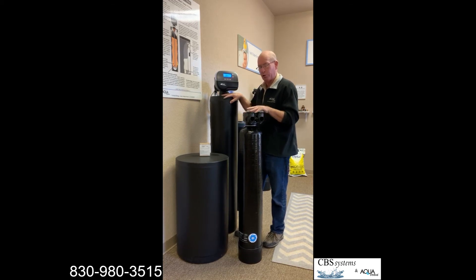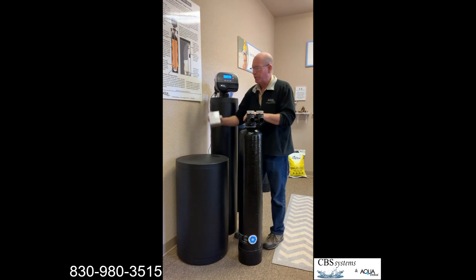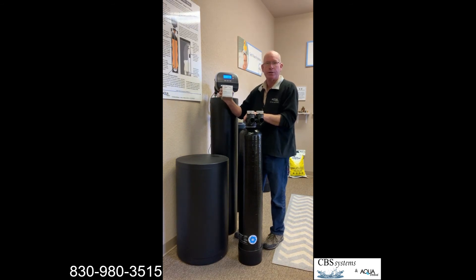So when you hear of a water softener that does not use salt or have a drain connection, be wary. They'll sell you that and then say, 'How do you prove it's working?' — and the answer is, 'You just have to believe it.' We install equipment and want to know it's working, and we can prove it to you with a chemical test kit for peace of mind.